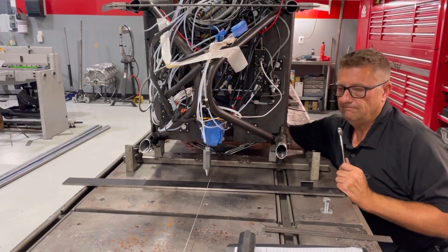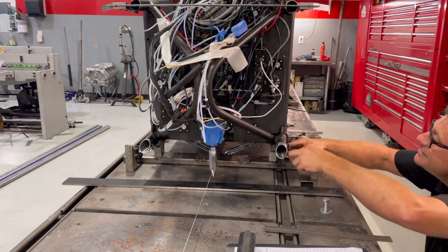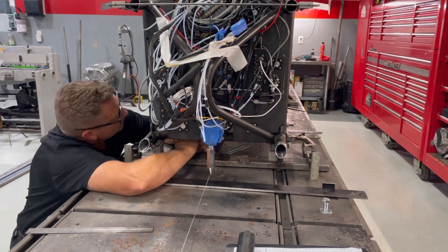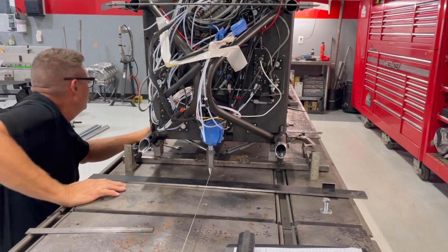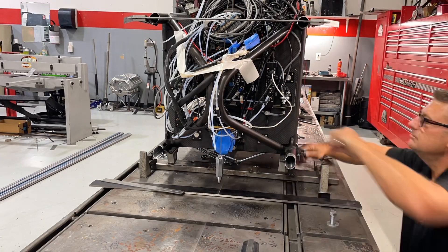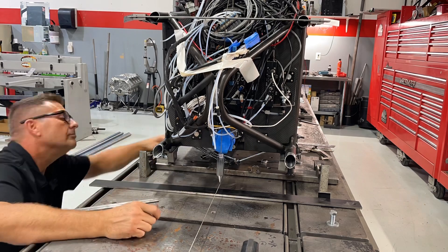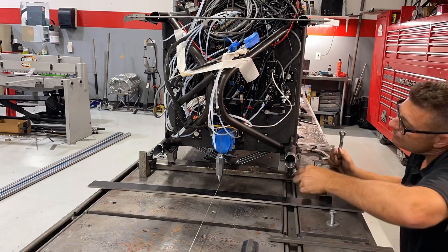I'm going to show you some of this but not all of it. I have to adjust this chassis to the arch that I want — moving it up because I want the motor angle different from what it was. I want this car to arch up easier, especially under hot conditions when the track's 120-some degrees. That's what my cars do well, and this is part of that experience.